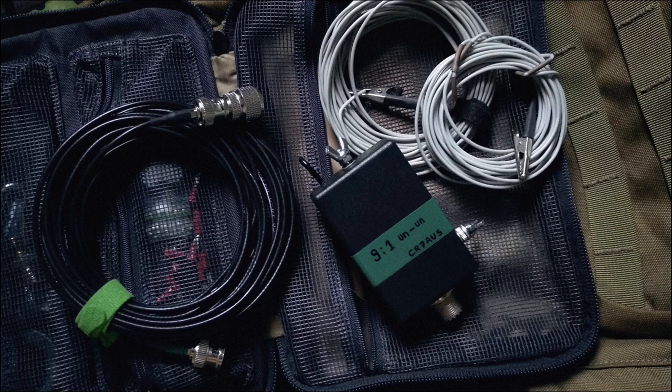The first image here is one of his — I believe it's three antennas. This is a 9-to-1 antenna that he uses. Nine-to-ones are great for putting up when space is limited; you don't need quite as much real estate as you do with an end-fed half-wave or a dipole, depending on frequency. The downside is they do require a tuner to use — they're not resonant on any given band without a tuner. In Carlos' case, though, that's not a problem at all, as I'll show you in a few minutes.